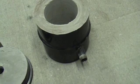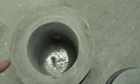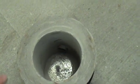And you can see my inlet for my burner. That's what it looks like on the inside — you can see it's offset. I still have to make the plate for the bottom of the furnace yet. Going to cast a plate out of refractory, put a hole in the bottom of the furnace and then make a plate.